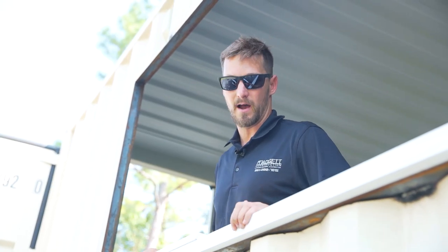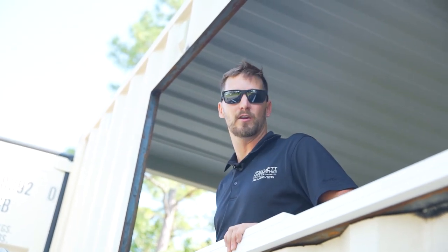The reality is that that was the full size of the window, not including the bucks, or you would have to subtract 3/4 of an inch all the way around for the bucks. So I ended up 1.5 inches larger, both width and height, than I should have been on my window frame. But you can always fix things. I could have gone back and changed my window frame, but it wasn't worth the additional work. There's a little fine tuning with moldings and stuff that you can kind of fix.